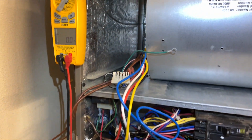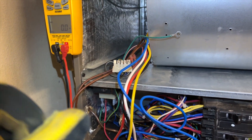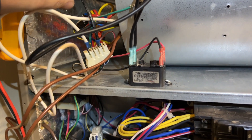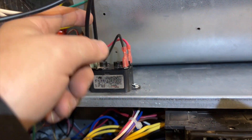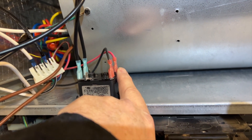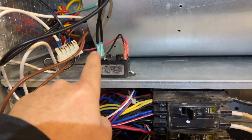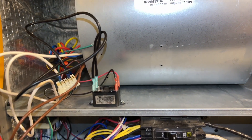It's very important that you understand what wire goes to what. We've got everything wired up: line two is the white wire, line one is going from here into the relay, and then the high-speed blower is coming out of the relay. I have my common and my hot — when I receive a call, this will energize, which should close this relay. It's a normally open switch, so it will close and allow 240 volts to power through that motor and turn it on.